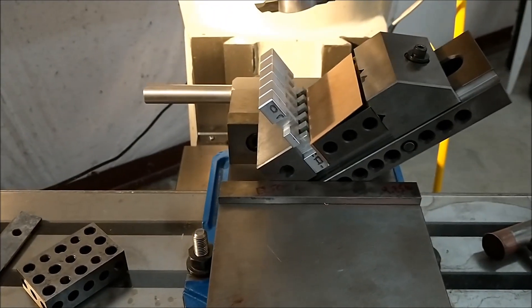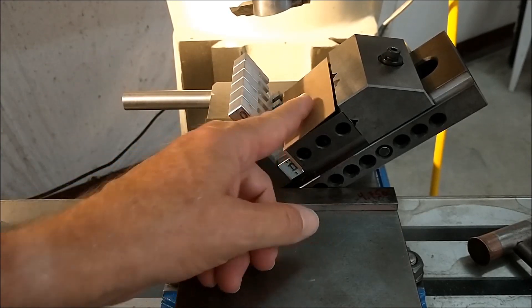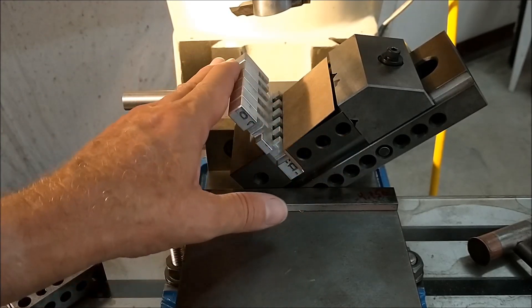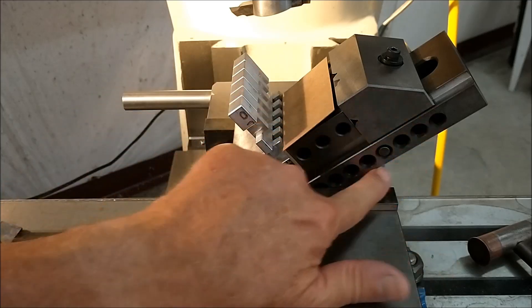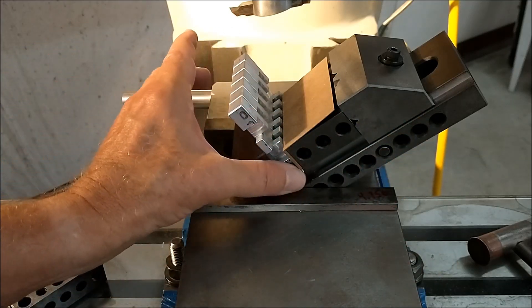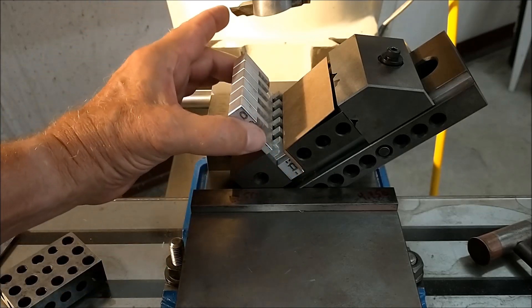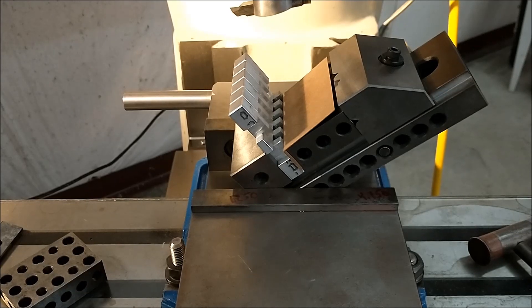You can now angle cut all of these pieces right across the nose, all secured based on this setup. If you're not happy with the end squareness of the part, lay this vise on a surface plate sideways so that you have the benefit of the surface plate establishing squareness of the set that you've just loaded. Those are two techniques that I use quite often in here.